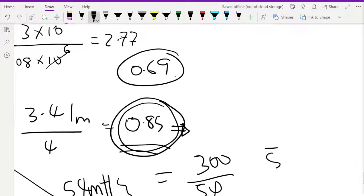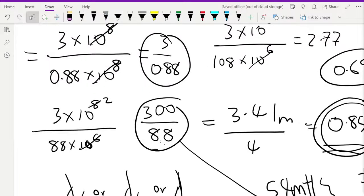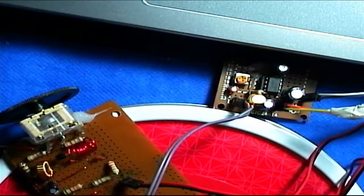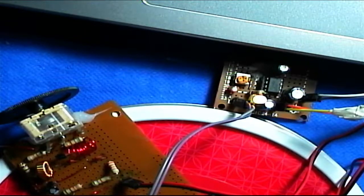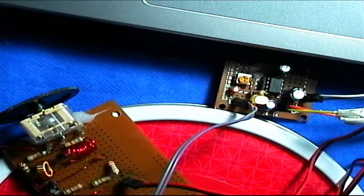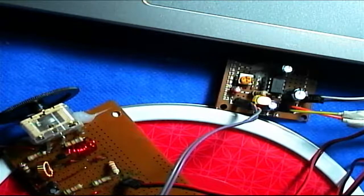So 300/54 = 5.55 meters full wavelength; divide by four and you get about 1.3 to 1.4 meters — a lengthy antenna but that's how you calculate it. That's how you calculate the antenna length. So that's it — that's our radio receiver right there. The radio is very sensitive to touch or the presence of other materials around it because of the air-core inductance, so we're using a metal can here to try to create shielding, but you can still notice some noise and fluctuations in the signal.